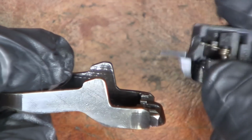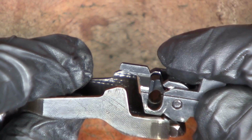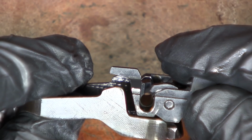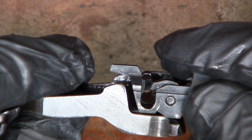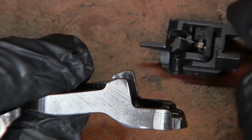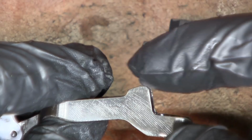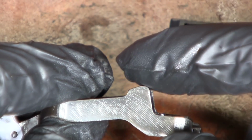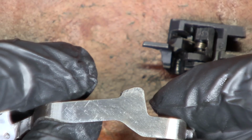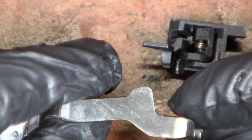So then the gun fires, and remember, we're still kind of holding on to the sear here, even though we pulled in double action, right? We caught the sear. So then the gun fires. The slide has little notches cut for these arms of the trigger bar, so that the trigger bar can move in those notches in the slide. You'll see them when you look at your slide.